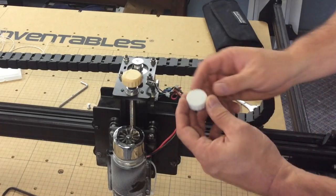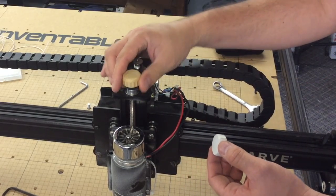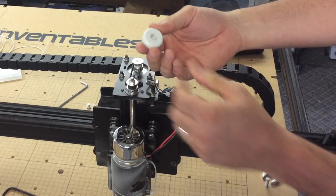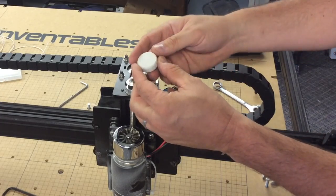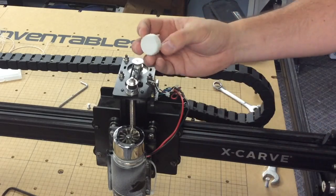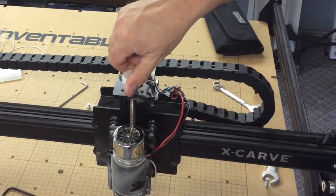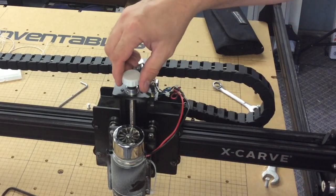The first thing I printed was a new knob for my X-Carve. This one worked fine but it's really hard plastic and it's got slippage even though it's got these little nubs on it. So I decided to print this one which is softer, just a little bit rubbery. It came out pretty good. I got some pitting on the top because it printed this way, and the bottom was really a mess because it's hard to get it off the bed. So I put it on my sander and it sanded pretty nice. It's got a nicer grip than the hard plastic and it stretches right over the nut very nicely. I think it works better than the hard plastic — this is a great solution.